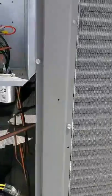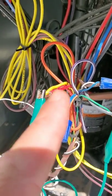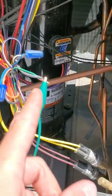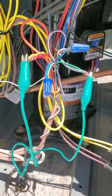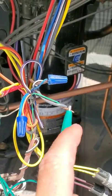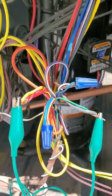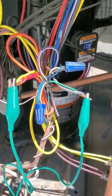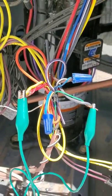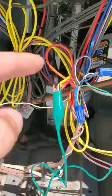So we're back now. Your green is your fan, your yellow is your compressor — your cooling — and red is your 24 volts. If you can't get to the suite and you're up on the roof and just want to test it, you can actually jump out with a jumper — like these little alligator clips you can get from electronic places. The fan has to have your 24 volts calling for it. I have my fan on green, my power is 24, and my yellow is cooling. So I have the cooling and the power jumped together with my fan. All three of them will be the 24 volts that activate your cooling and your fan, your indoor blower.